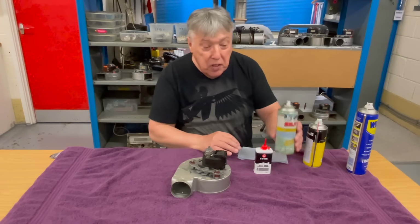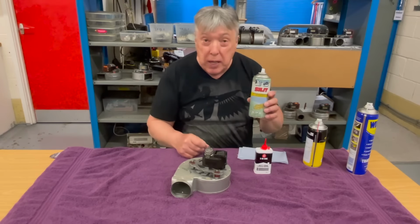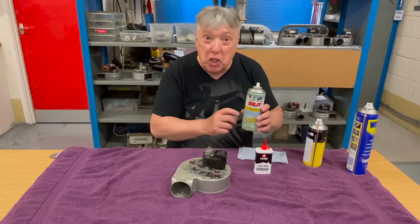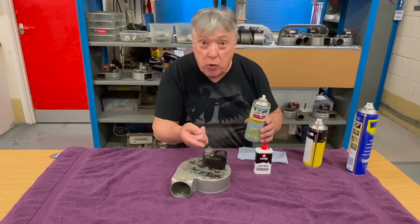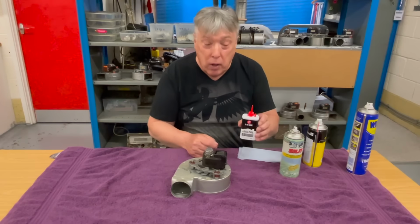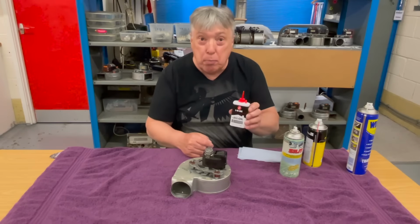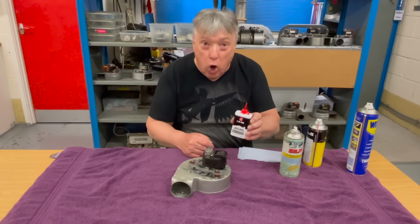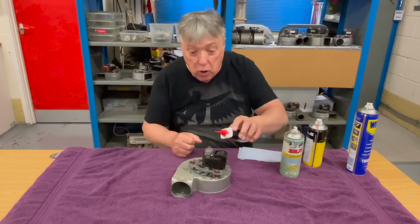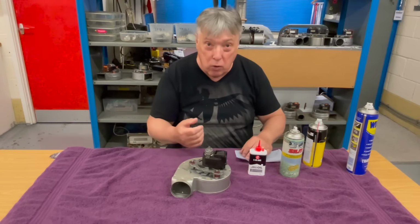And obviously we're going to use some more of this. Now we've got silicone. Now you would think silicone in here was very good, but it isn't, because when silicone gets hot, it gets gungy and greasy, which is not a lot of good here. Then we've got our favorite 3-in-1. This is absolutely excellent for lots of things, but it has the same problem. As this gets hot, it goes greasy and really thick. So you can put a few drops in here and then it will gradually grind the fan to a halt.